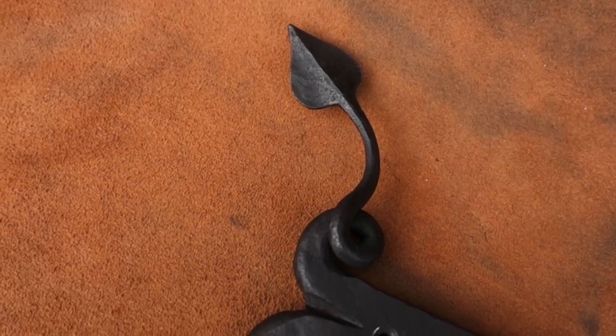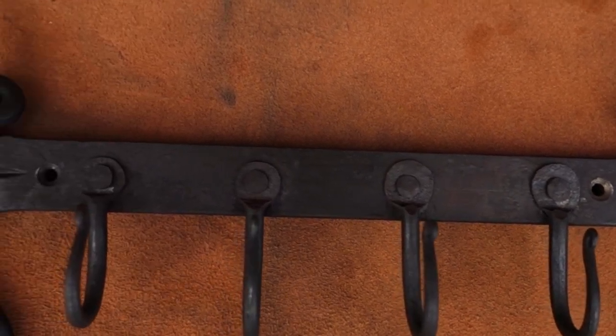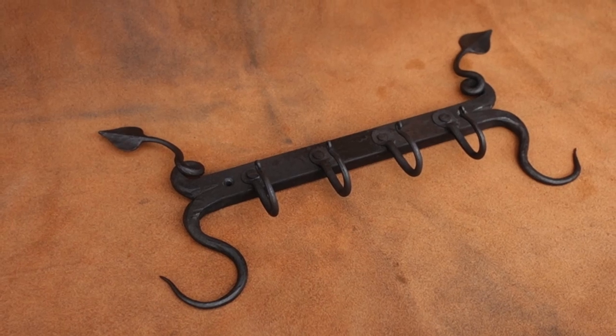There we are — there's the finished hook rack. We didn't perhaps use the most traditional method of blacksmithing to get there, as I did drill all the holes rather than punch them, but on this particular style I like having those parallel sides top and bottom rather than punching the holes which would give a swelling — so it's more of a design reason than a blacksmithing reason. Obviously you can punch them if you want but you will get a little bit of swelling on either end. You can put loads of hooks on these, make it as long as you want — a metre long hook rack with 20 hooks or whatever — they can be lengthened and shortened however you want, and obviously put lots of different designs on. I just did this sort of Art Nouveau flowing natural design with that whiplash on the bottom. Thank you for watching the video, I hope you enjoyed watching me make this hook rack, and I hope you can go into your garage or back garden or wherever it is that you make stuff and give it a go yourself.